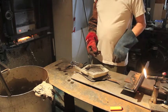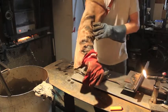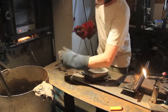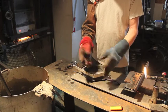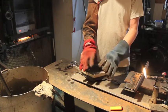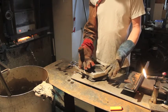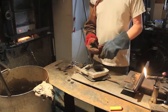I have a sleeve that I wear, which is a welding sleeve made of leather. I wear it on one arm only, because this is the arm that goes near the furnace and this is the arm that goes into the annealer. The other arm can just be bare. I also have a pair of insulated leather welding gloves — they're like $15 or $20 a pair and they're kind of disposable depending on whether you're grabbing at stringers, though they can last a long time.